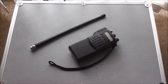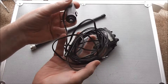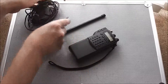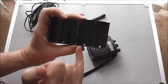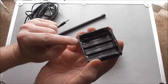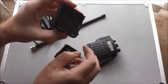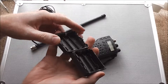So what I'm going to do today is convert it to 12 volts. I've got this cigarette lighter lead for the car — it came off a solar panel trickle charger that's long since departed, but I kept hold of the lead. What I'd like to do is wire this into the unit. In the battery holder, down the bottom there's a little bit of space with no contacts, so I'm going to cut a little hole there, feed this wire in up to the top, and solder it onto the contacts at the top — the minus and the positive.